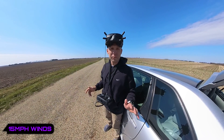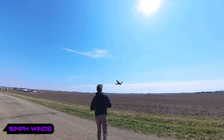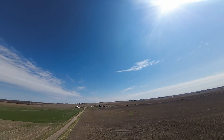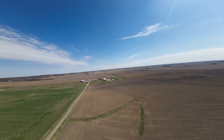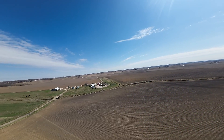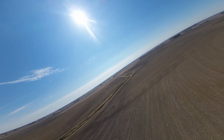It's a little windy — here we go, she launched! This is oscillating because the PID adjustments are off. I didn't mess with any of that stuff; of course we changed the flight controller, it's got two motors, a lot going on. Now it figured it out and leveled itself out.